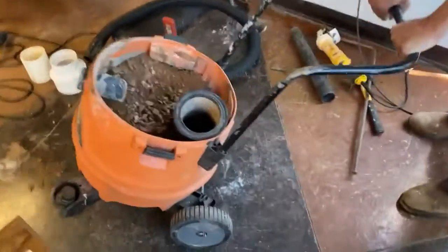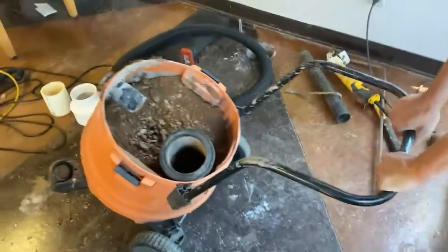This is a good sign that you're going to get rid of your radon problem — if you can fill a shop vac one or two times, you get a good suction pit. We got well over 15 gallons of dirt out, which is what you want. There's a lot of gravel and sand. We were able to get to the footer on this wall and to the concrete forms, so there'll be an air pocket that hopefully travels around the perimeter of the foundation. The building is about 17 years old, and we found that quite a bit of dirt had loosened and was falling off the slab itself, which gives you an air pocket that moves laterally across the slab. That's what results in good pressure field extension — the technical term for being able to pull air from the other side of the slab, meaning you no longer have a radon problem.